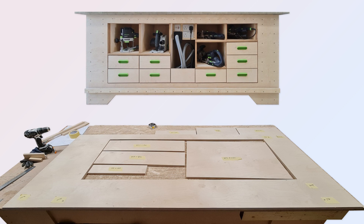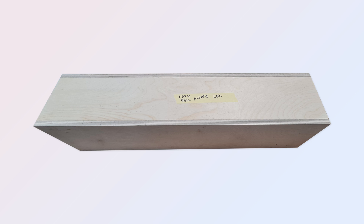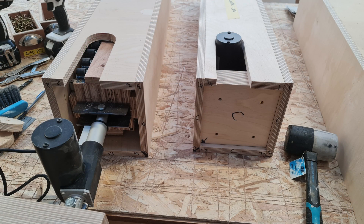The bench front and back were to be covered by a portion of a long sheet with a central cutout, so there was an opportunity to harvest approximate offcuts from the two sheets, saving me cutting into an additional full sheet. The legs were marked A, B, C and D with corners marked one to four, dominoed and dry fitted. A cutout to allow the actuator to be in position then had to be made, and I used a hole saw and jigsaw to make the curved slot.